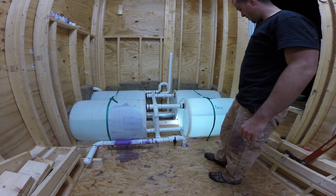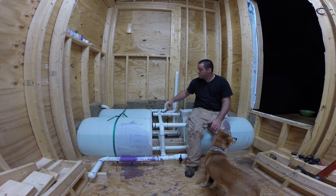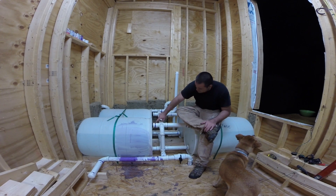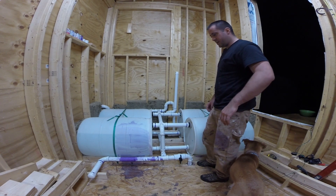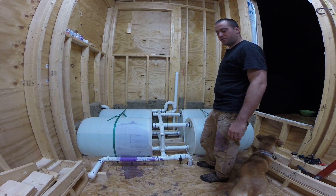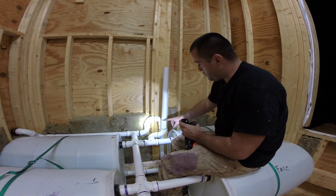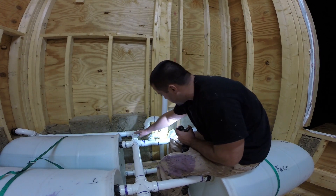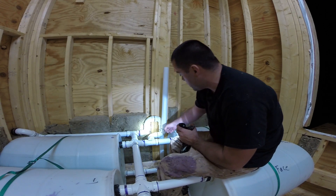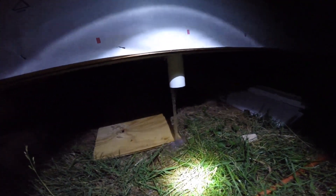And I am right there. That is just cool, I tell you what. It's kind of ironic that it's actually raining outside, but I'm not catching the rainwater — I'm filling it with a garden hose. It's just getting to the bottom of the fitting here, so I'm almost at full capacity. These 2x4s were a good idea. My vent pipe is filling up with water. Now when that vent pipe gets to this point, my overflow is going to engage. The water, instead of filling the tanks, is going to come up and pour over and start pouring down. There's the overflow — and it's working properly. So I can shut my water off and let it sit.